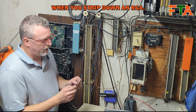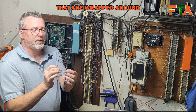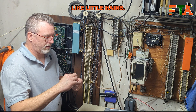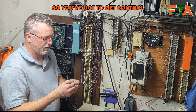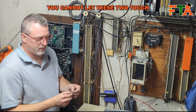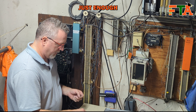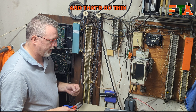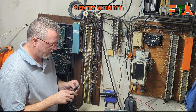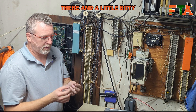When you strip down an RCA, you're going to have a set of wires that are wrapped around an inner jacketed conductor. These are braided - separated like little hairs - so you've got to get control of all of them. You're going to end up with two conductors. You cannot let these two touch because they'll short out the signal. I'm going to get all these together and strip this back just enough to get it into my Phoenix plug. It's so thin it won't work on my strippers, so I'm going to do this gently with my needle nose. So I've got a little conductor there and a little conductor here.